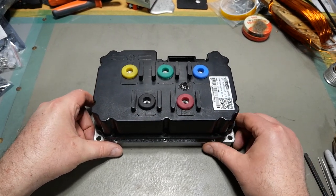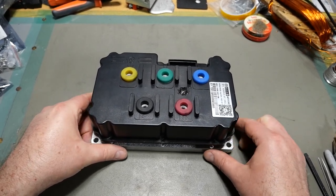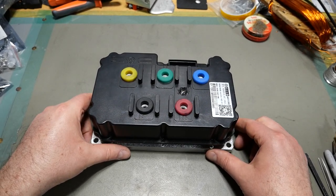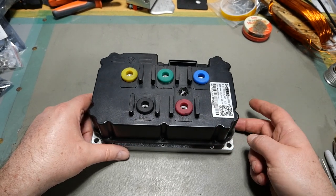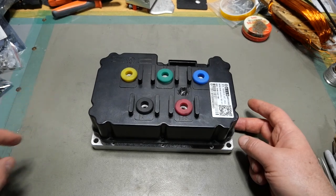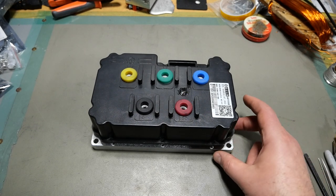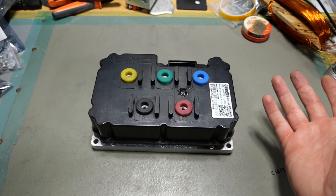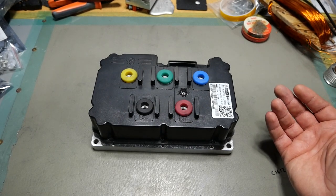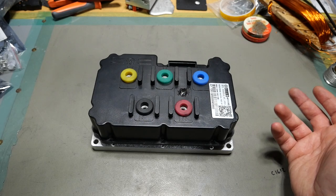Hello YouTube, Dee Baudry here. Welcome to EV Components Review. On the bench today is a Fardriver 96850. This controller has a bad flash — or so I've been told — and so it doesn't work. I had to depot it to at least be able to get to the programming port so I can try to re-flash it over ST-Link and hopefully get the thing running again.